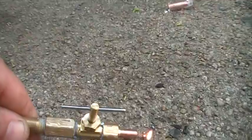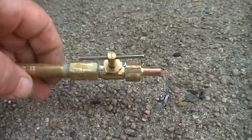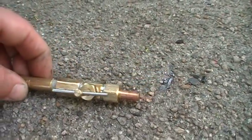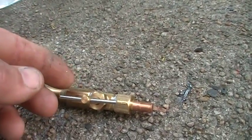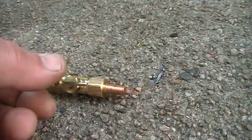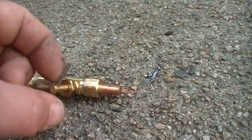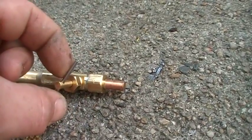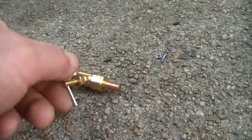I've got a little needle valve here. As far as a flame arrester goes, I don't have a huge flame arrester on this. This is a number 6 — it's a 0.6mm MIG welding tip. The stuff I've got going on in here is just brass wool. I'm going to do one with sand and a spring because it's less restrictive. I only have a small amount of brass wool in here. I had it filled all the way to the end, but it was no good — it wouldn't let any gas through, it was too restrictive. I get a little pop when I shut it off, but not much. So far it's working great, I just need to get a little more production out of it.